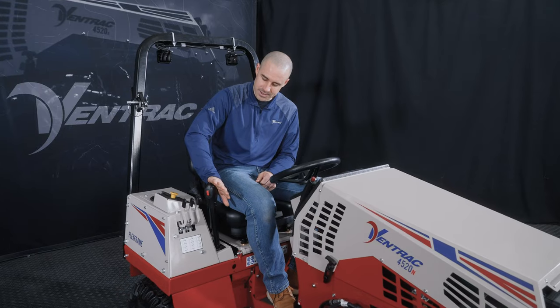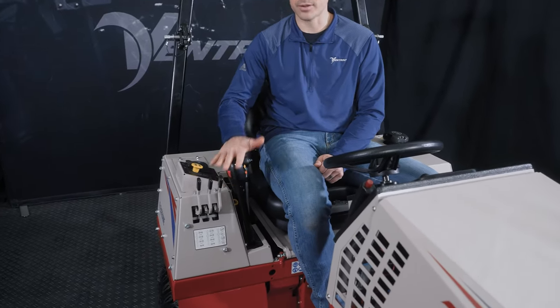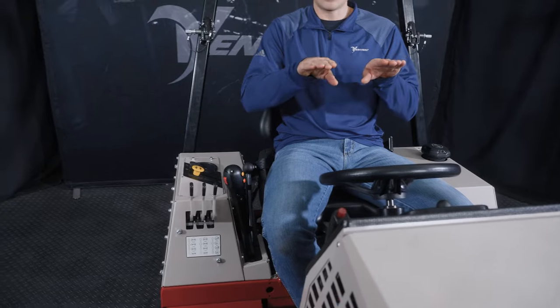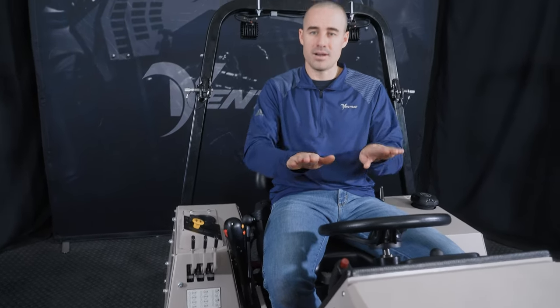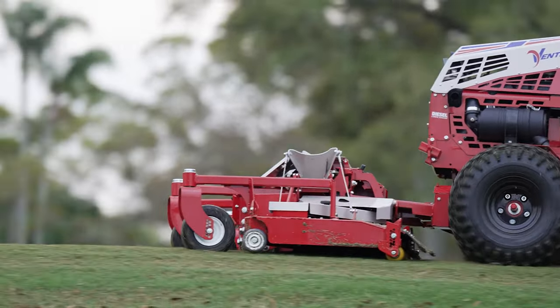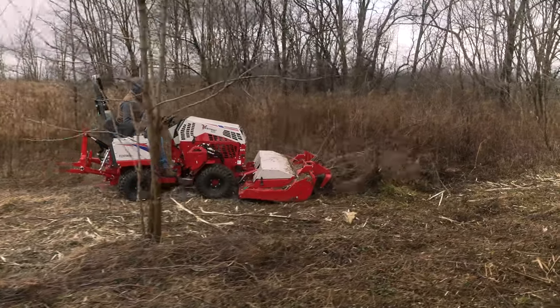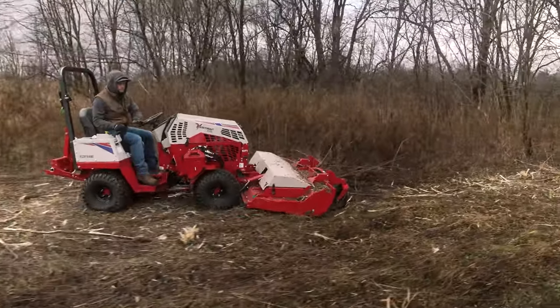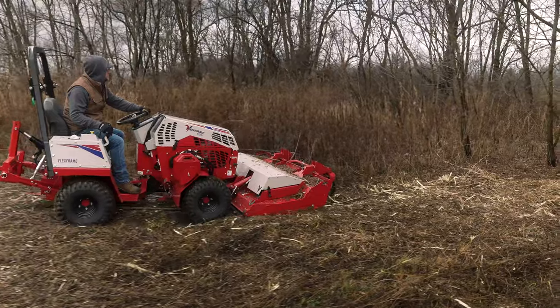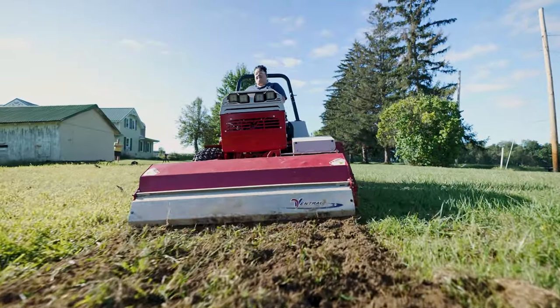So you push up against it and then it goes right past. And if you're in that detent, then that is float. And what that does is it lets the hitch arms of the tractor follow the contour of the ground, so the attachment rides along the ground. Of course, with a front-mounted machine, this is very, very important for anything like a mower deck or something that's ground-engaging, like a tiller, a power rake, anytime you're working on the ground surface.